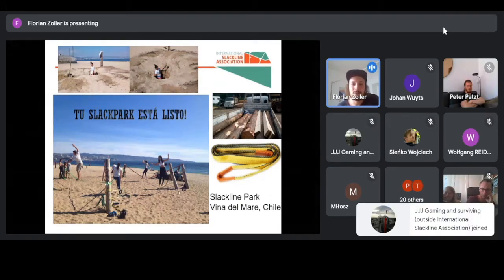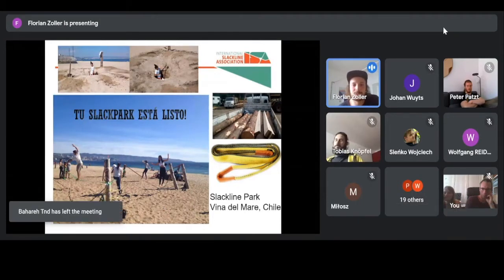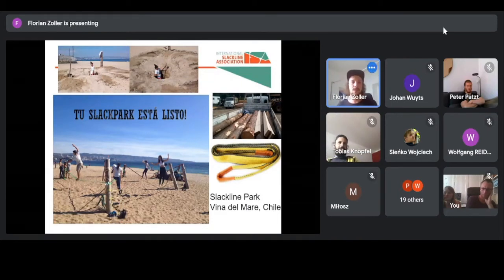And one thing you should consider when placing poles in parks is that you try to compact the ground around the pole, maybe with a vibrating plate or by foot or something. This gives a lot of stability because sand is not like concrete, of course. Sand is like gravel. It deforms a little bit until it has deformed so much that it settles down and is really compact. So as we can see here, the poles are a little bit tilted sideways, as is the pole back there.